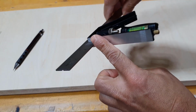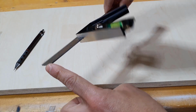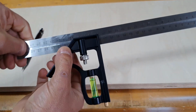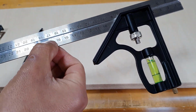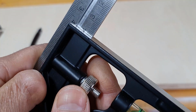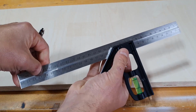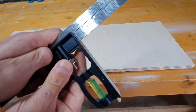If we want furniture that is correctly made, useful and durable, it is mandatory that it is constructed from panels with angles of 90 degrees, as well as the joints between furniture panels. Therefore, drawing lines and intersections of lines are a basic principle and procedure in carpentry. The device consists of two main pieces, a steel ruler and a handle that slides on this bar, with a nut that tightens the fixing screw when we want to set this combination square to the desired measurement.